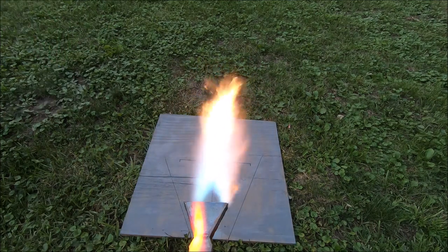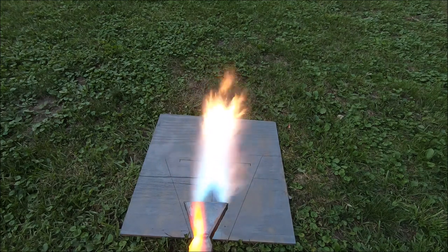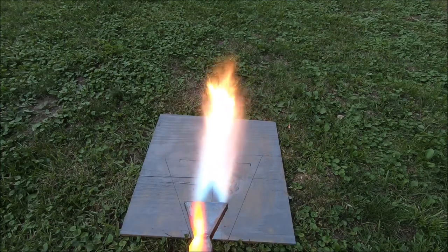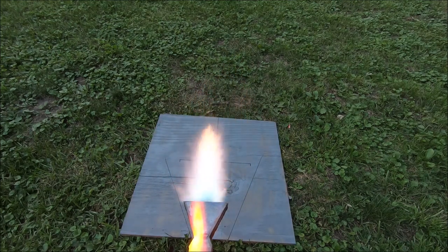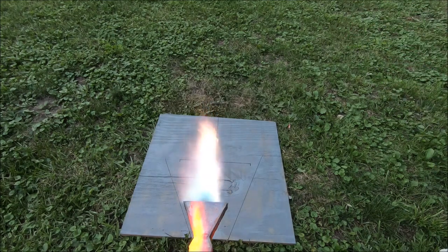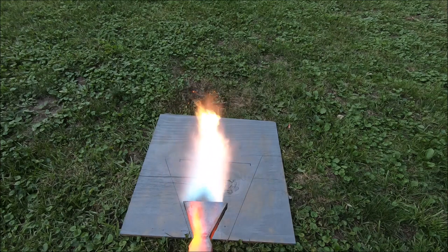You can see some irregular heating on the left side — we just have to shim up the nozzle with copper shims or some other mechanism. I want to thank Eric for inspiring this build. He requested a wider, flatter flame. What I'm observing in this test is that if we flatten the beak to a narrower height we would get a wider flame — see how it kind of gives up on the edges, there's just too much area for that much flame and its velocity. But if we restricted the flow a little bit by tapering down the beak on the exterior, or just narrowing it even more, that would possibly give us a wider fan.